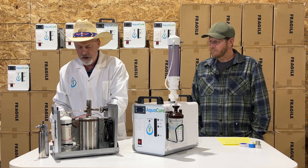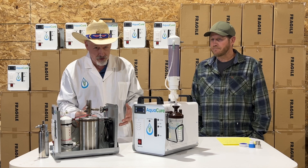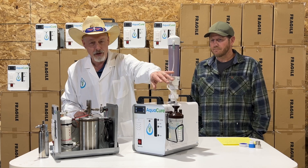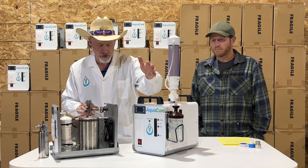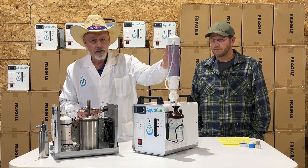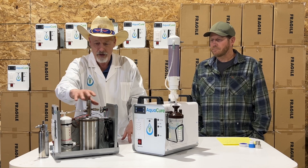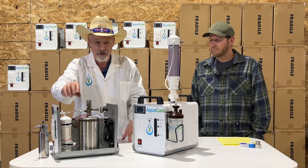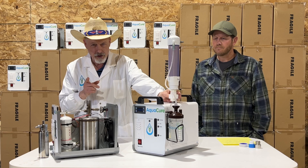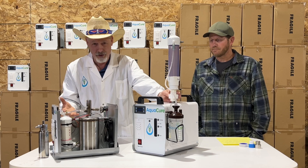When you get hot gases, they hold more moisture. The moisture isn't really water droplets — it's a vapor that can come out of here and get trapped over there, because this is a cool solution and it cools it down and condenses. This is one of the reasons why we have a tower cap, because over here there's no stopping that vapor. As this thing warms up, you're going to get more water vapor — or solution vapor in this case — which has more lye in it. So we want to separate out those vapors. There are machines out there on the market saying you don't need a tower cap at all — that's simply because they're lazy and they don't know what they're talking about.